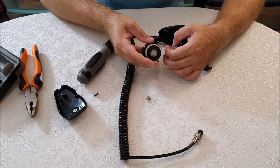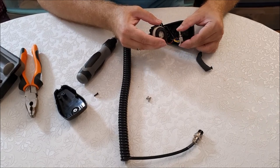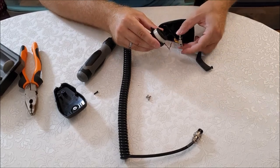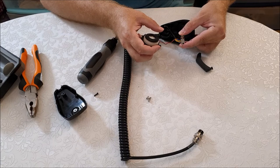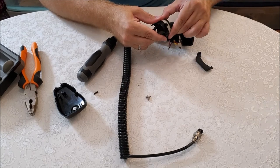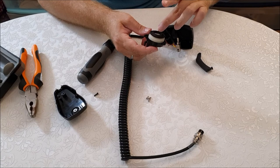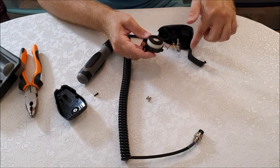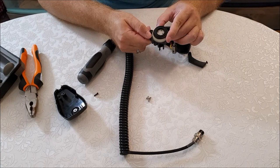So you have the two wires going into the mic - the red one is positive, the black one is negative or ground. I don't think it has circuitry, it's just plain wiring in the button. When you push it, it switches the signal from input to output. In this case, because you don't hear sound coming from this - you hear sound from the unit itself - when you flip the switch on you put the live wire on and it can start transmitting; the mic is listening to you.